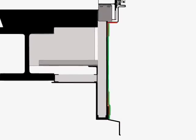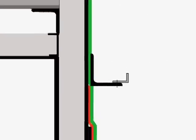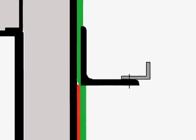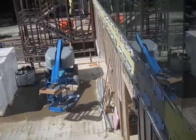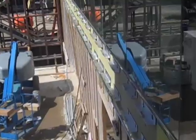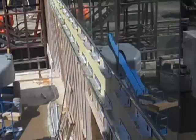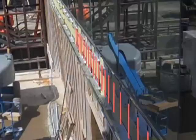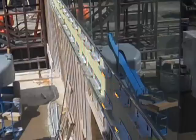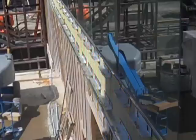Once the air barrier is complete, insulation can be adhered to it. But first, steel clip angles are attached through the air barrier and sheathing to the same metal studs that support the sheathing. These clip angles are rather long, considering that they only need to provide one point of support for the stone veneer. However, their length is determined not by the point of support they provide for the stone, but rather by the requirement that they be attached to at least two metal studs. Because each piece of stone needs four supports — one at each corner — and each point of support in turn needs a clip angle spanning two studs, there ends up being quite a bit of clip angle material attached through the sheathing.